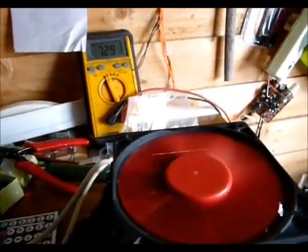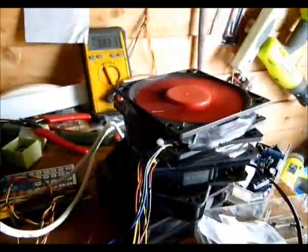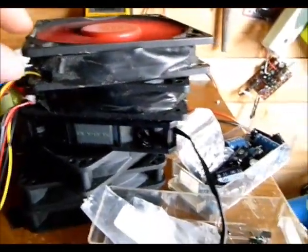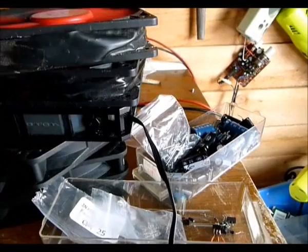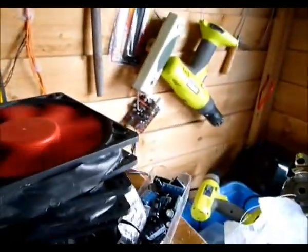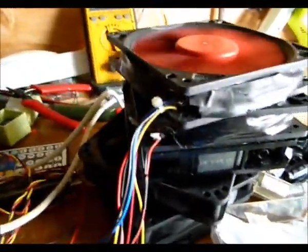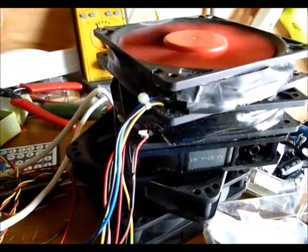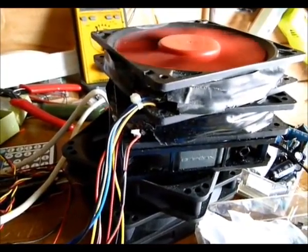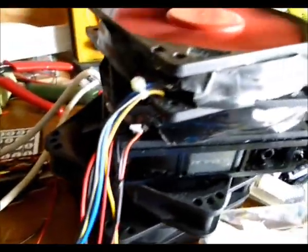From 0.1 amps up to 0.55 amps - that's a pretty good coverage, all user-adjustable. Set your own fan speeds and fan curves. If you wanted to run silence fans or BitFenix Spectre white fans on this converter circuit, one solution to the problem of it not going low enough would be to just use two fans to increase the current. Alternatively, just use a different potentiometer - they do 10k ones as well. I just happened to buy a 5k one to test.